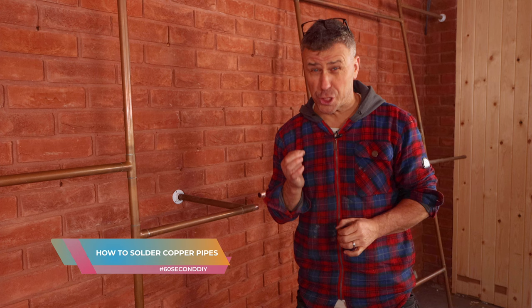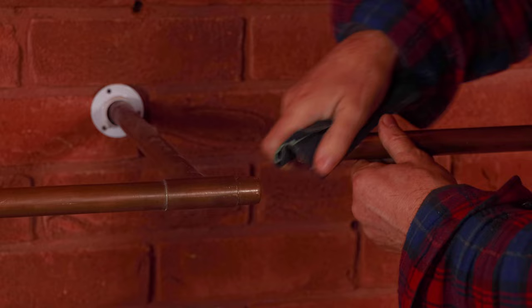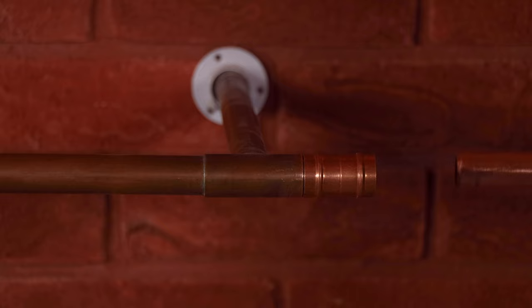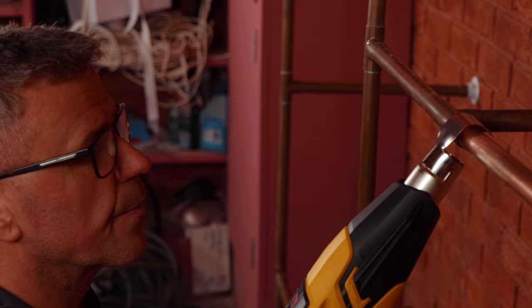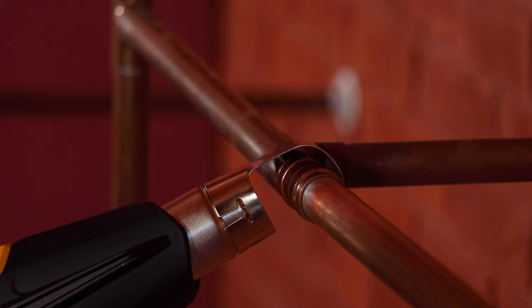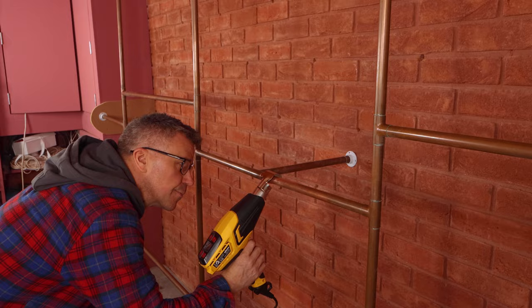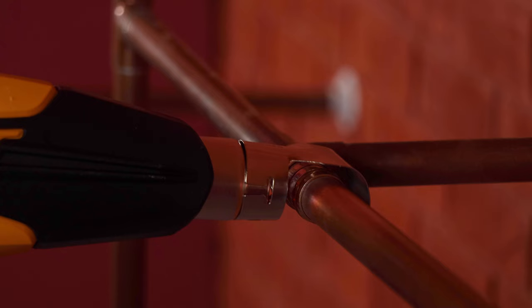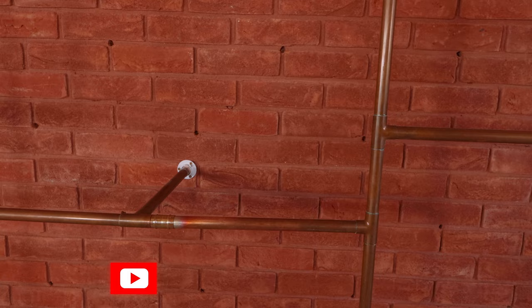In this video I'm going to show you how to solder joints so you can connect copper pipes. First, cut your pipes down to size using a pipe cutter. Before you try to solder any copper pipe, make sure it's cleaned off with some emery paper or wire wool. Then slide your joint on, fit the other pipe in between, and then you can start to apply the heat — I'm using the Wagner Inferno. This normally only takes a couple of minutes. The joint I'm using already has the solder within it, which I find easier to use. The joints I'm soldering aren't to hold any water — I'm just creating a clothes rail out of copper piping. That's how easy it is to cut, piece together and solder your pipework. Don't forget to like and subscribe and leave us a comment.